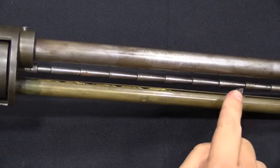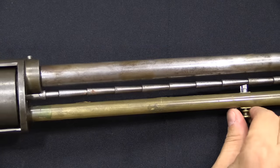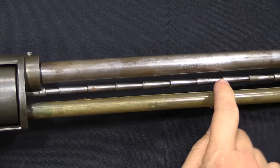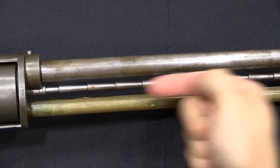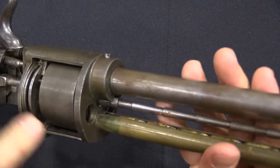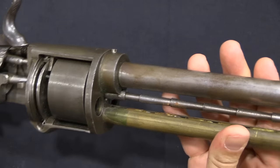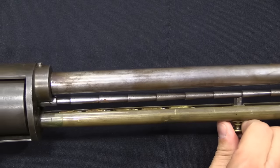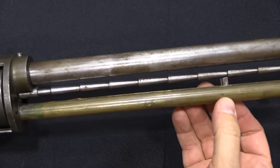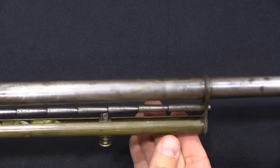I have a follower that I have put out here. When that rod goes forward, it is in essence going to pull the follower until it snaps up. And then when the gun is fired, this rod is going to go backward, which is going to pull the follower back and stuff one of these cartridges all the way through this into the bottom chamber in the cylinder. Then when you cock the hammer for the next round, it's going to push the rod forward over the follower again, and when you fire a second time it pulls the follower back and loads another cartridge in. So that's how that element functions.